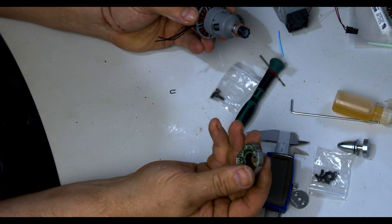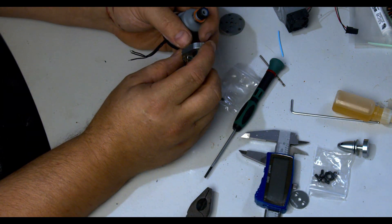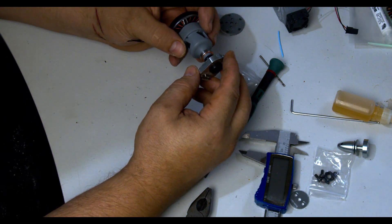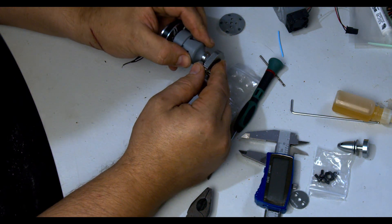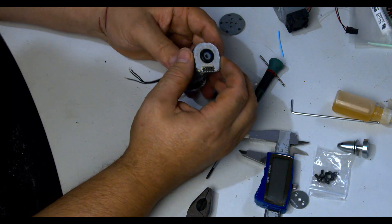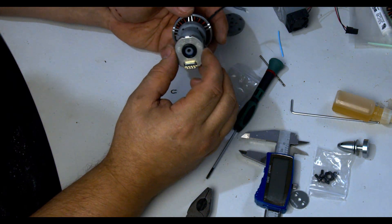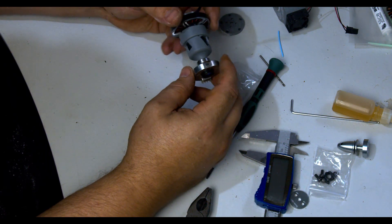So that's our encoder mount. This is one of the encoders that I've been using. What I'm hoping to do is take the internals out of one of these and just mount it all straight into the extruder bracket. Now that sits into there and then pushes into here like that. That's why that alignment is so important, because it has to run through the center — and that's how you get your positioning.